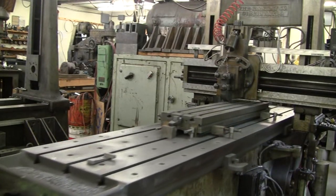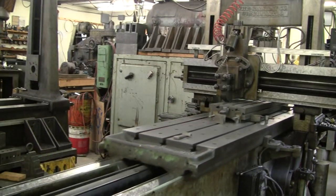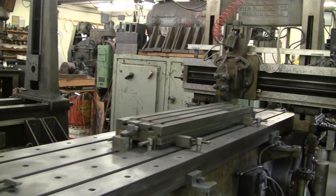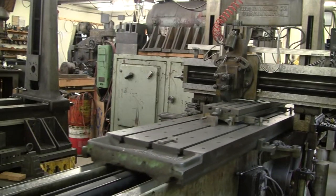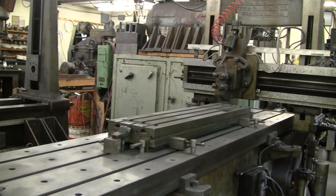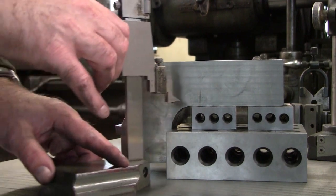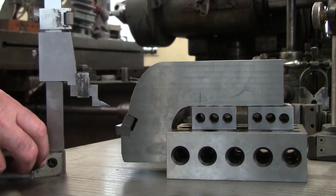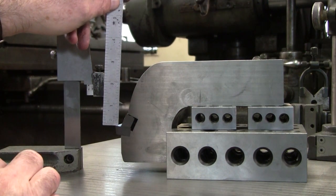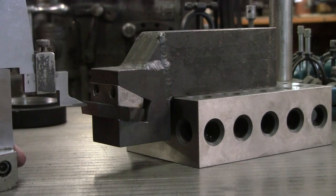If the trailing edge of the tool is a little higher than the leading, then this is of little consequence. But if exactly parallel, the trailing edge will cut a little deeper into the surface than the rest of the cut. For this reason, if the edge is exactly parallel, either the cut should be gauged so that the final stroke is about a full feed width, or alternately the cut should be taken very lightly, possibly a spring cut. I made this holder 45 years ago, just knowing that the edge must be behind the shank. The offset is extreme, but has remained my favorite tool. Here is another I made, this one with the edge even with the shank. It seems to work well too.